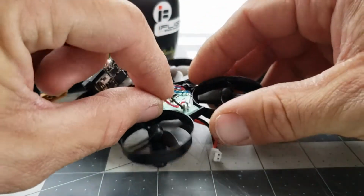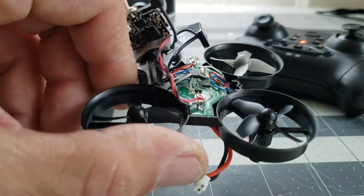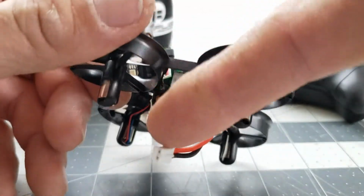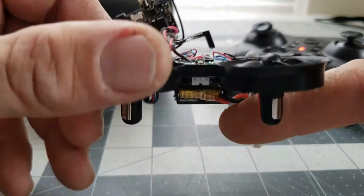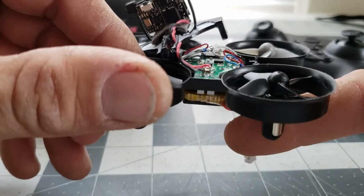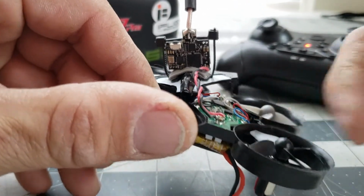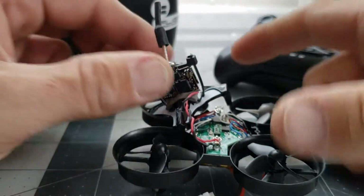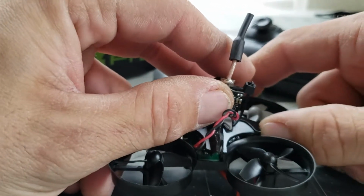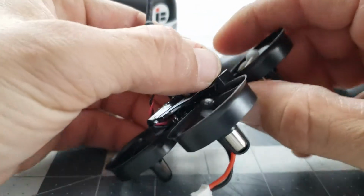And I just soldered it to the rear terminal points. You can see here for the battery, it's just soldered right onto the tips of the back side of the plug there. So the back side of the board, the pins for that plug, I just soldered right to. Really easy to do. Just make sure you pre-solder or pre-tin your wire and your terminals, and it'll connect really easily. And then I just feed the wire out the back like so. This little canopy just pops on with a couple pins, so it makes it really easy to pop on and off if needed.